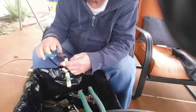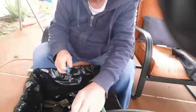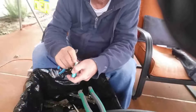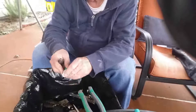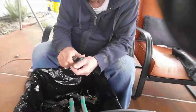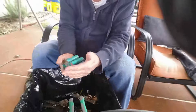That's how you take them apart — it takes about 20 minutes to crack them open, get the cells out, and clean them just enough to go into the charger. All the ones that test above 200 milliamps I recharge. I have to re-heat-shrink them because the black glue I scrape off after removing the tape damages the original heat shrink badly. I clean off the black residue, heat shrink them, recharge, and test — and that's what we're going to look at now.